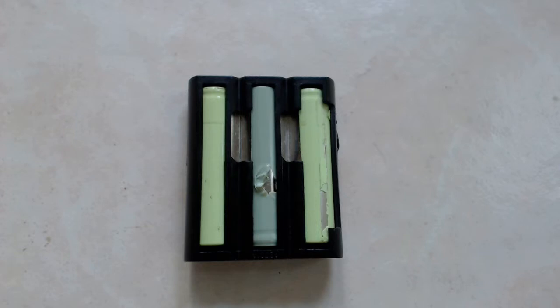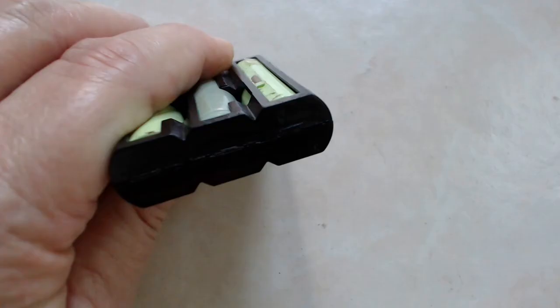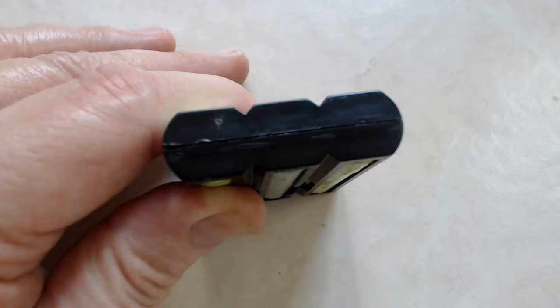The factory-supplied batteries for these calculators worked quite well. You had a plastic-encased three-pack battery with two metal strips that made contact with the brushes on the inside of the calculator. The battery just dropped in place and the cover went right over it. This particular battery pack uses three AA rechargeable cells and is for demonstration purposes only. Again, you can't buy this battery pack now.